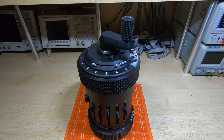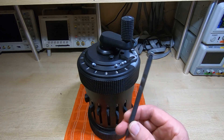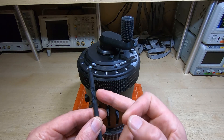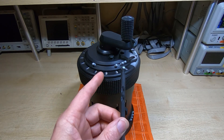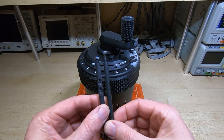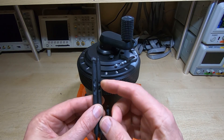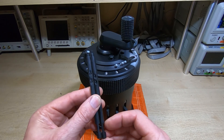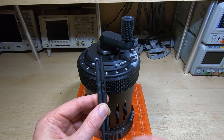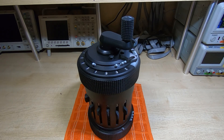The other question was whether the modified shaft on the reversing lever worked the way it should, and yes it did. I've made my own version - this is the original, and this is the new one I've since installed. It's one where the dimples are in a different place. Other than that it's the same size, but it's locating the reversing lever into the correct position.